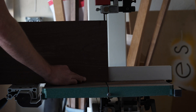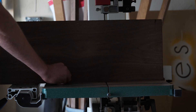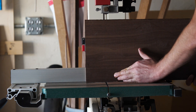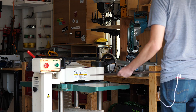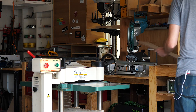One thing that's key if you want to do that is starting out with wood that's the correct thickness, or about a quarter of an inch thick. I, unfortunately, didn't do that, which meant that I had to re-saw and mill a three-quarter inch thick board into two quarter inch boards, and in doing that use an extra couple thousand dollars worth of equipment. But either way, we're both at the same point now with our quarter inch thick material, so let's get cutting.